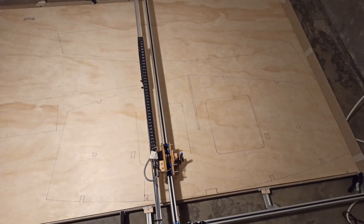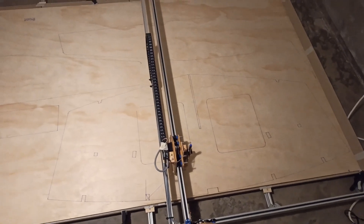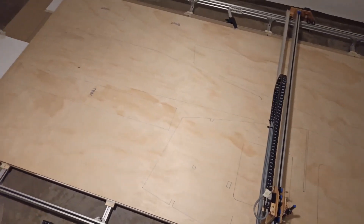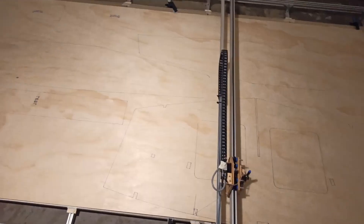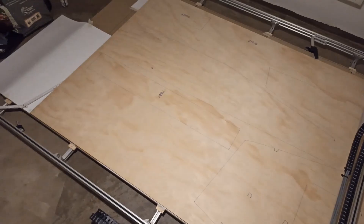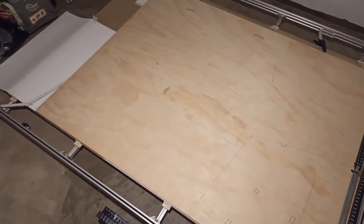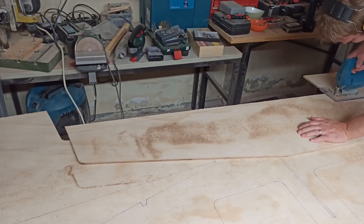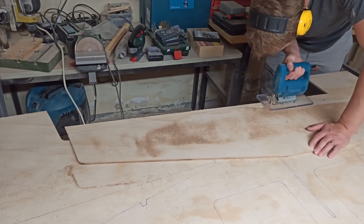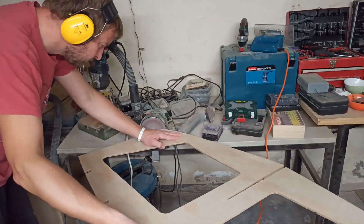The making of the individual parts is more or less the same as for the rudder and centerboard. All plywood parts and beams on the inside are made of pine wood. The outer beams are made of ash wood. The flat parts were drawn on the wood with my CNC plotter and then cut out using a jigsaw, and of course some sanding was also required.